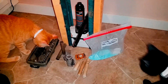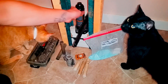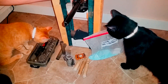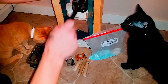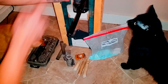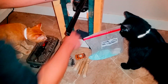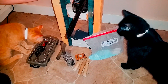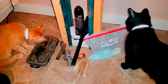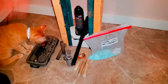Let's start with the press. Any arbor press, hydraulic press, or pneumatic press will work. What I have here is a simple homemade hydraulic press that lifts up and you can crank down. This piston pushes it downwards and I have a steel plate down here. Just going to press that downwards. Angle iron, some wood for support — simple.